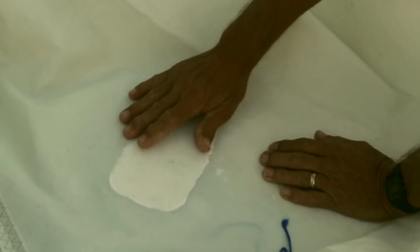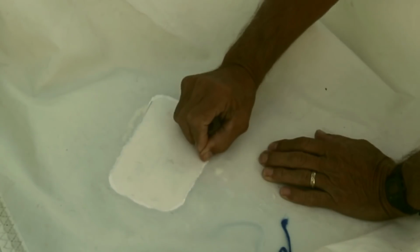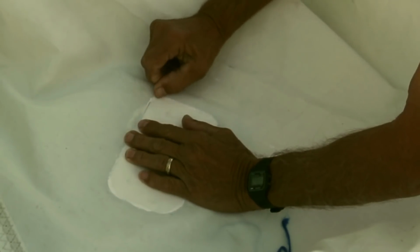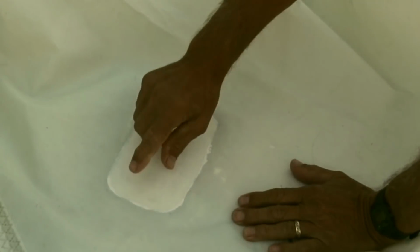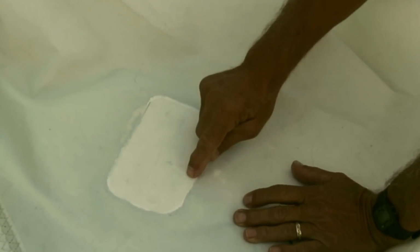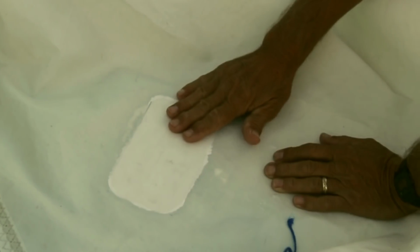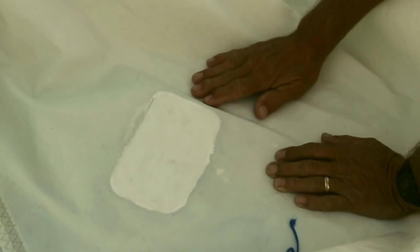Yeah, so this 5200 doesn't stick that well to dirty surfaces, but it certainly did to this area where it was sanded and then cleaned with the acetone. That's a very good adhesion. This is better than sewing, because sewing would just leave perforations all the way around the edges. And that's the only thing that would be holding the patch onto the sail. With gluing, it's 100% surface contact. You can't get any stronger than that.